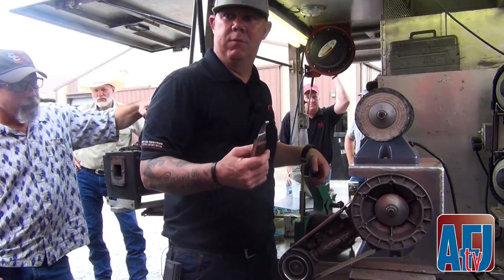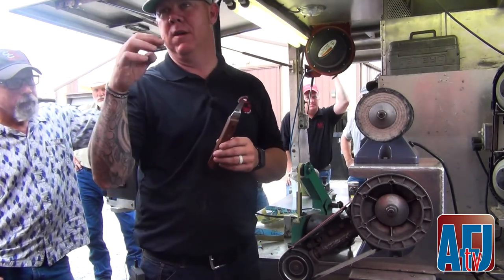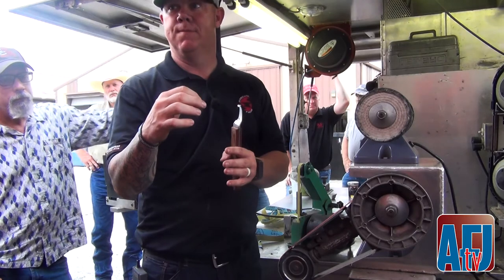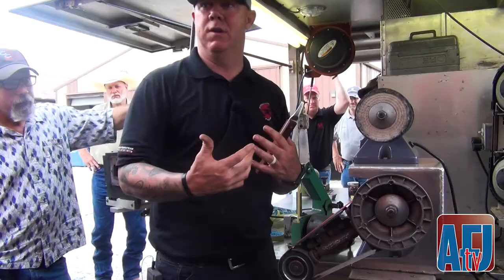That's the advantage of grinders that most knife guys have, because they're variable speed. I have two horsepower motors, but I can run them at 10 RPM with two horsepower. So you don't bog them down, but they slow down — that's an advantage. But we don't have that on the job.